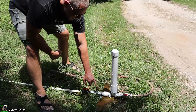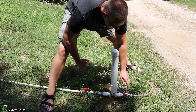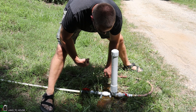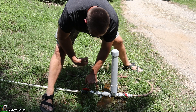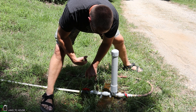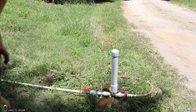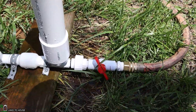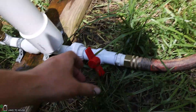Here's a little trick: pressing the valve means a lot of water is coming out the top and it's not maintaining pressure in the tank like it needs to. The trick you can do is slightly close the delivery pipe so that water is still coming out the top, yet there is back pressure against the pump. It's real tricky — sometimes you're open enough and sometimes not. I can slightly close it some more and get this to cycle. I'm seeing a lot of water pouring out the top, so we're not quite there yet. That might have done it. The valve is cycling, but the delivery pipe is about halfway closed. But it just stopped — not quite enough artificial back pressure.